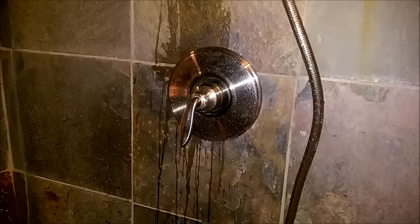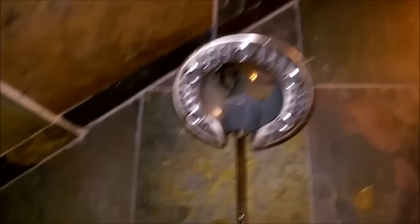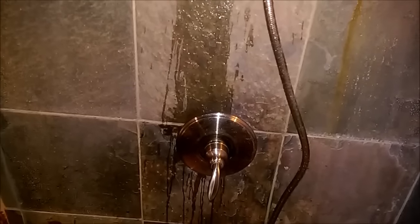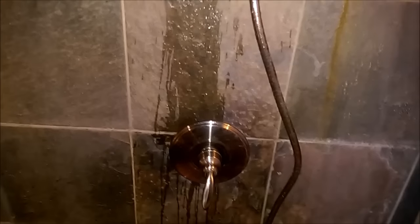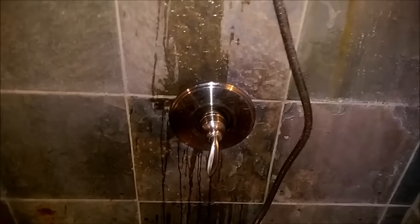One thing you might want to do while you're doing maintenance on your shower is look at the shower head, right at the joint where it comes out of the wall — there's going to be a screen there. Since you're screwing around with stuff, I'd take that shower head off and soak it. Get the screen out with needle-nose pliers or a razor knife, and maybe soak it in some Lime Away or some kind of descaler. Just clean it up while you're doing the maintenance. Anyway guys, make sure to give the video a like — hopefully this helped you out. There's a link in the description below to the replacement cartridge we replaced here in the video. Thanks for watching guys.